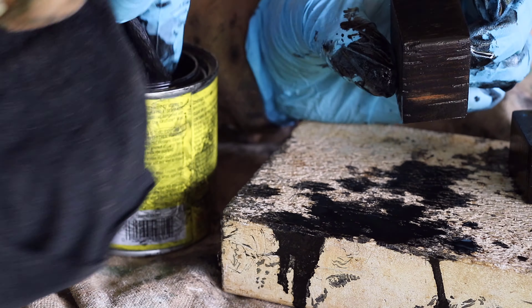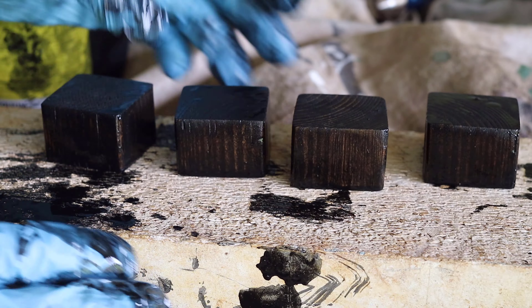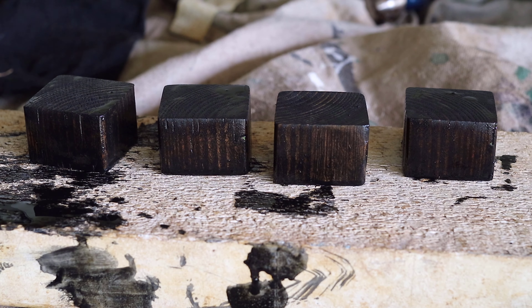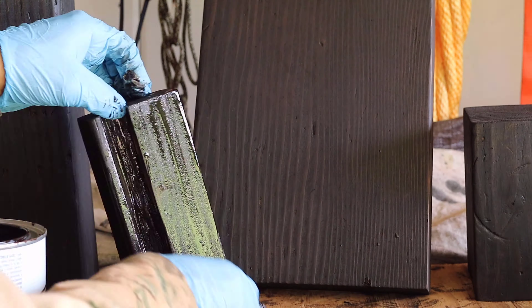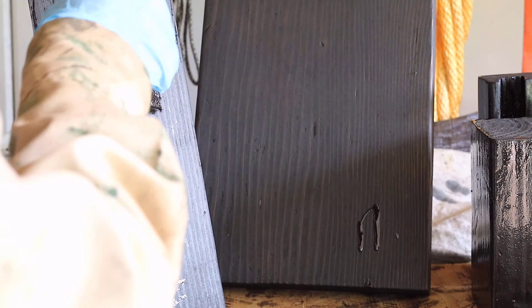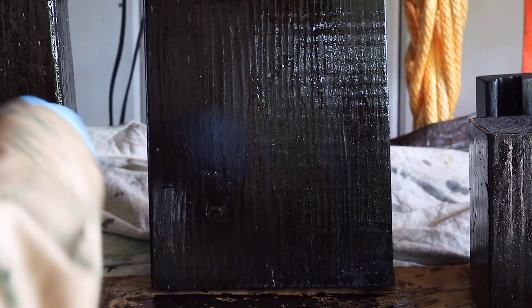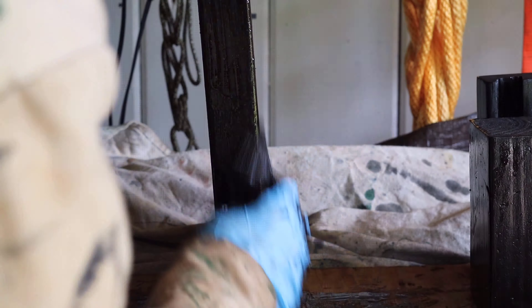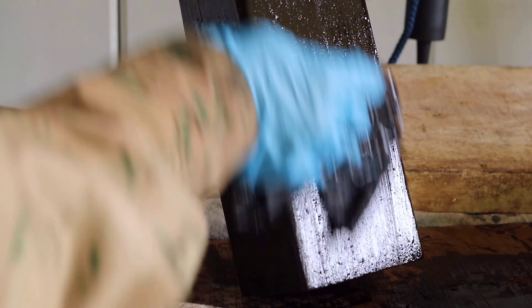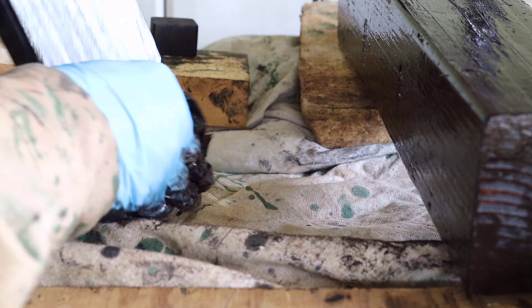After applying the wood stain and optionally wiping it off, you'd usually use some kind of top coat such as polyurethane. I also wanted to see how a dark polyurethane finish would look on the wood. I wanted these pieces really dark and I forgot that I already had polyurethane with dark stain premixed into it. The color of this combination polyurethane and stain is called mission oak. So although I had already stained it, continuing on with the experiment I chose to use the dark polyurethane and stain anyway.